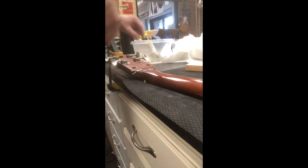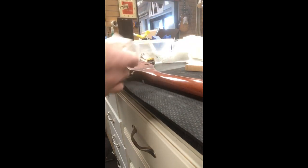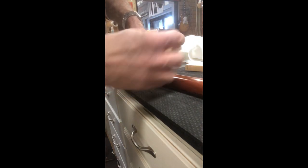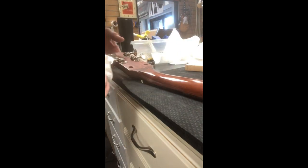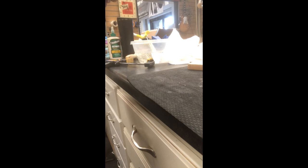There's a big open cavity in there, probably right behind the truss rod. I'm going to set the syringe in my water. Now I'm going to release the clamping pressure — look at all that glue! I'm going to go with paper towels first just to get that bunch of glue off. That's a mess. I'm going to put a little hand pressure on there to get a little more squeeze out, and then start putting clamping pressure on it. I'm also going to take a quick look at the truss rod access to see if I've got excess glue — actually the truss rod is at the heel on this guitar.